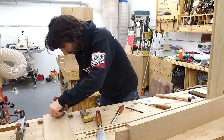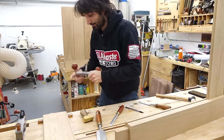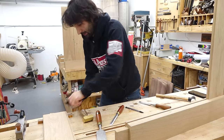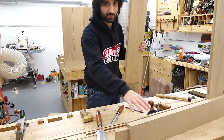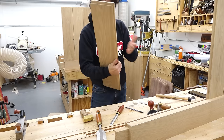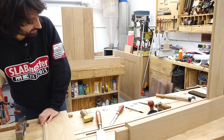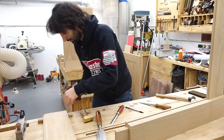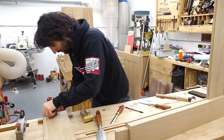And now, one question that some of you are going to have has to do with gluing and securing of these V-panel boards. So what we'll do when we do the glue up is we'll put a little bit of glue in the middle of each panel board, right in there, just to lock it into its position in the rail, and then it'll be able to expand and contract. The V-panel tongue and groove will float, and the tongues will float into the rails as well. So that's how we'll deal with wood movement in this, while still maintaining consistency with the gaps between the boards. The gap width will vary with the seasons, but they will be consistent, so they'll stay the same distance apart relative to each other.